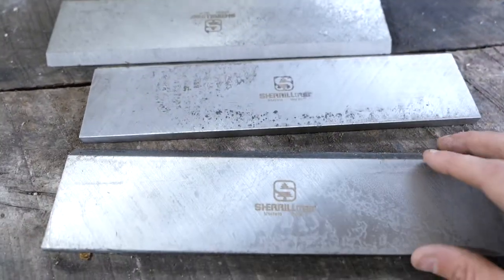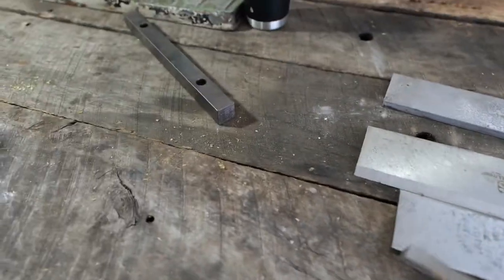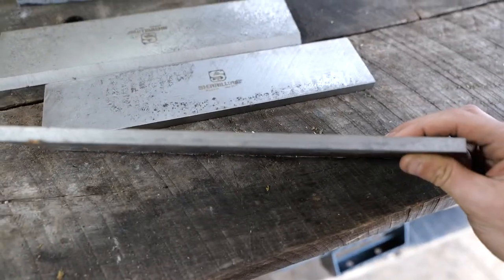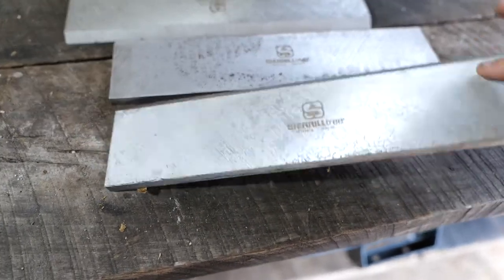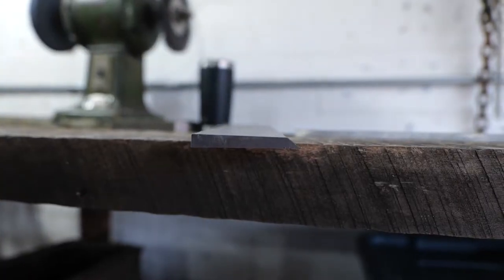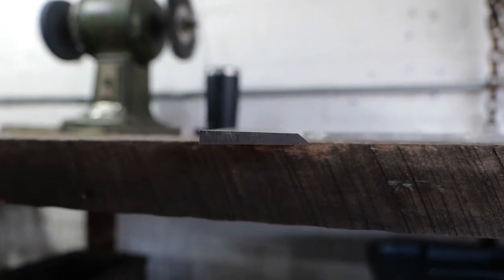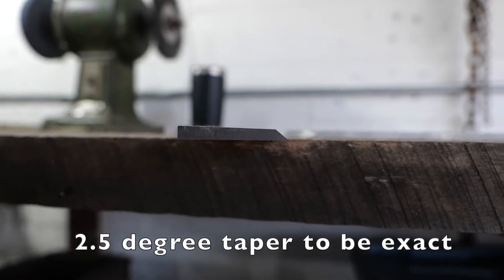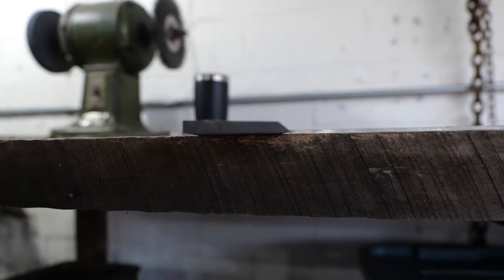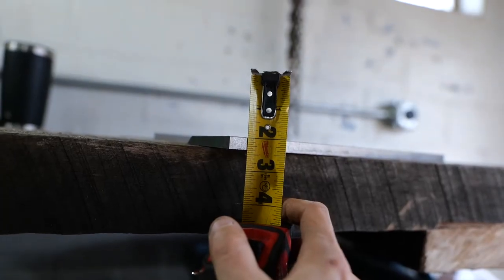But anyway, these blades here, I compared the length to that anvil, which is 12, and these are exactly 12. And so they do have the end taper on them. There, so there's your end. And I don't know if you guys can tell, but the two flats on each side have a taper, and then the blade itself has a taper as well, which does look to be right around 40. That does look like 3/8.